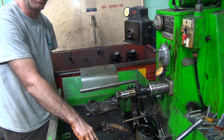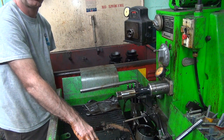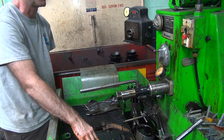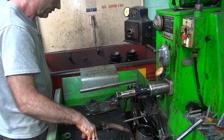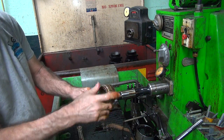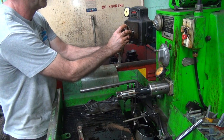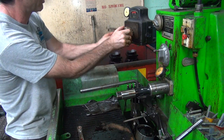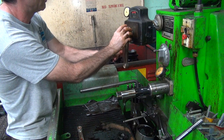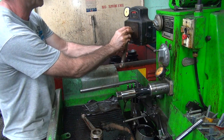It's like painting your car — you've got to sneak up on it. Start with coarse grit, keep going finer and finer. I'm just going to make it a smooth shine. Everything has to be at room temperature to be accurate; otherwise when it gets hot it expands and you've got more numbers. Everything's got to be the same temperature. Better to leave a little on than to take too much off.